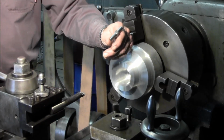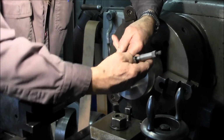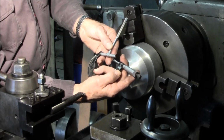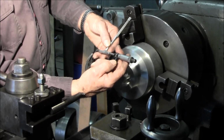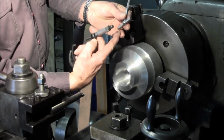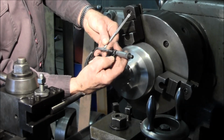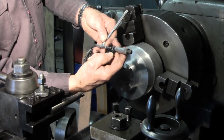Alright, let's grab our outside micrometers, and we'll try to get this in a better view here. You put the butt end on the anvil, and you can lightly move that. Keep one end stable. I got my finger underneath this end and against there, so that it stays there. And then I can get a little bit of motion here, because you're going to want to feel it when it's hitting that first contact point.